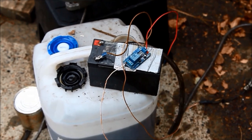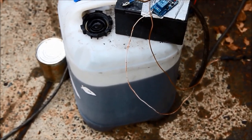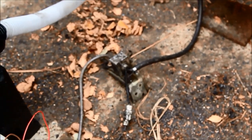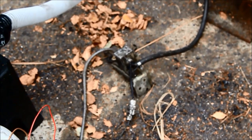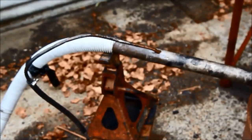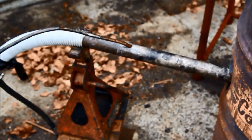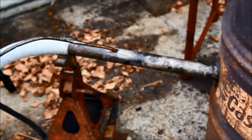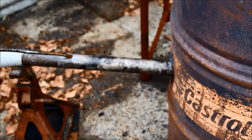This is my standard metered setup. I've got that little electronic timer sitting there on top of the battery — it pumps the oil out of that container and controls how long that oil pump, or fuel pump as it were, cycles on and off. This is a pulse-type pump, not a motorized pump, so it basically cycles on and off under normal operation anyway. We've got the blower there with the hose going up to send the air into the burner, and the oil pipe on top — the oil is simply pumped up and dribbled in, and then the airflow blows it along into the burner.